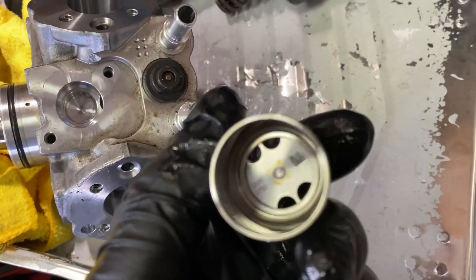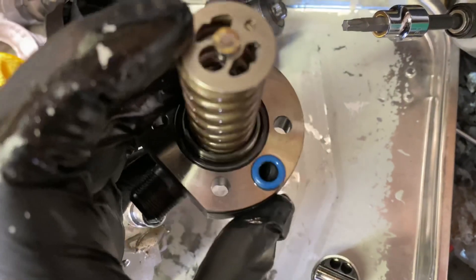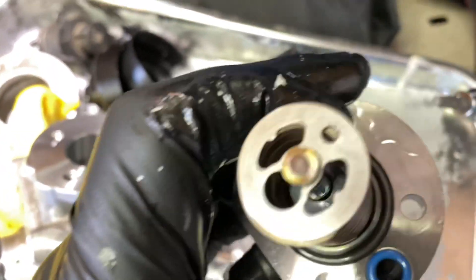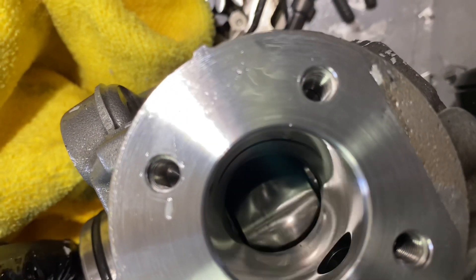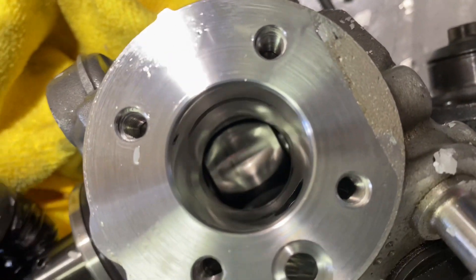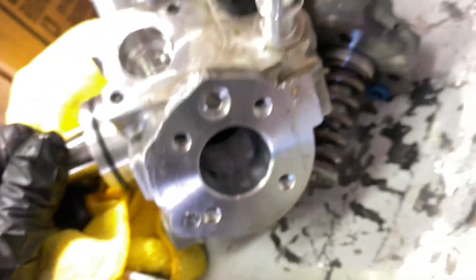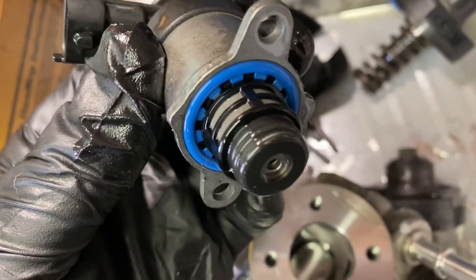Here's the other one — not quite as much play, maybe not even a sixteenth of an inch — it's very little but it's enough when you're rolling at 20 to 28,000 PSI. This one has a little bit of rust in it too from the heads. This is where this one sits — all that is is just that little retaining washer, doesn't look like it's clocked any particular way. Wear marks and blemishes on that — that's to be expected, intimate contact. Other than that, O-rings looked good, everything looked good, the shaft looked good, no play. There's the turning — that's what essentially creates your movement on both sides. The mesh filter did not have any mess in it.